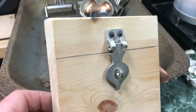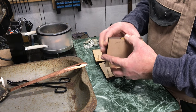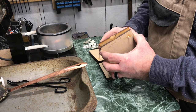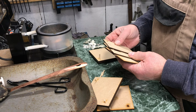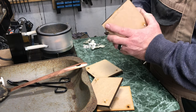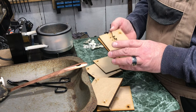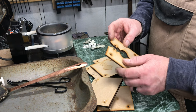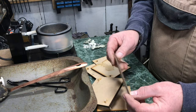I'm going to show you how I went about casting this and how I put it together. The first thing I do is draw up a quick design of how I want the hasp staple to look, just on a piece of paper. I work at a school and we have a laser cutter, but you don't need one — you can still do it in a shed. I drew the shape in 2D design software that the laser uses, but you can cut these out by hand using a fretsaw or a scroll saw.